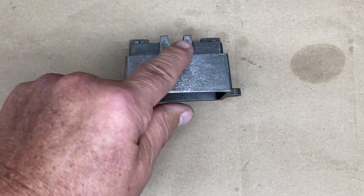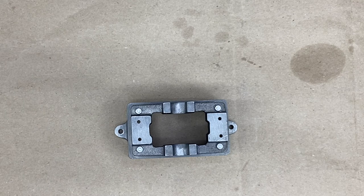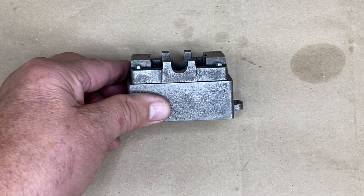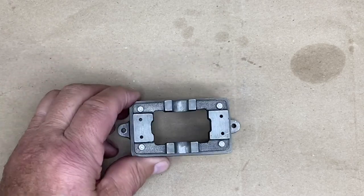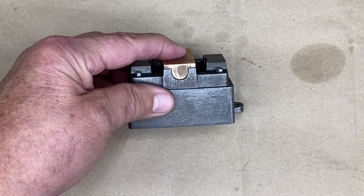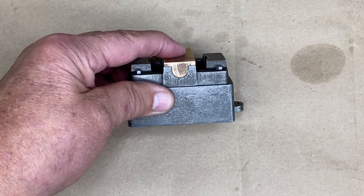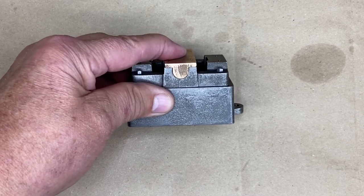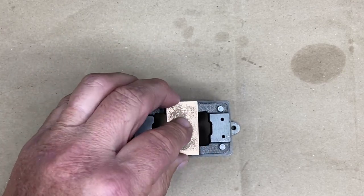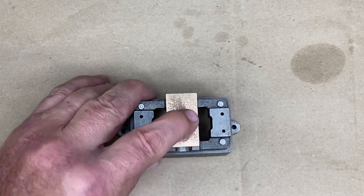Then these contours here, that's where the bearings sit. I did not have a mill, so I used a hand file, which is an okay way to go. And what fits in there is the bearings, and this is the raw bearing material. The outside dimensions are pretty much finished, so I just used it as a pattern and filed and filed until I got everything so it fits, and it fits very nice since it's flat.